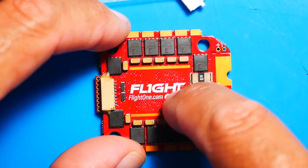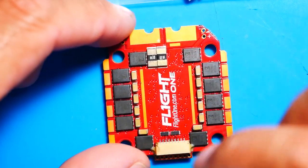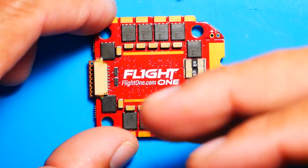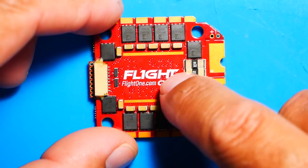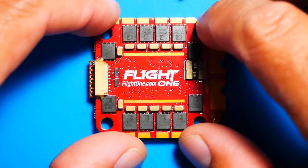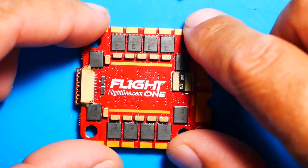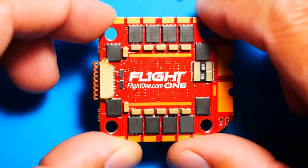The very first thing we're going to talk about is this big empty space right here. You could fit a lot more capacitors there, get a lot more filtering, and have a much cleaner ESC running. But they left this spot open for two reasons, because there are two types of pilots — racing pilots and freestyle pilots. For racing pilots, you put on an external capacitor, and there's a special heat sink you can buy that goes on here to disperse the heat so when you're pushing hard on your third lap, you're not overheating. They've actually seen racing pilots melt these ESCs, so they put real thought into this.